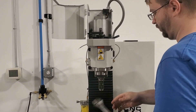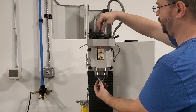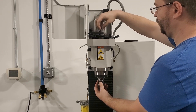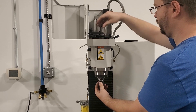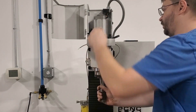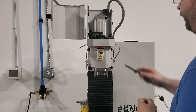One major distinction: on MX machines, you do not have to remove the power drawbar shaft since they use a BT-30 spindle. For any machine that uses a power drawbar, you will also have to remove the spring washers. Additionally, for MX machines, there is a guide sleeve that the spring washers are seated on — you will have to remove that as well. You will also have to remove the lock nut that is directly below the spring washers, and then the top hat, in order to remove the spindle pulley.